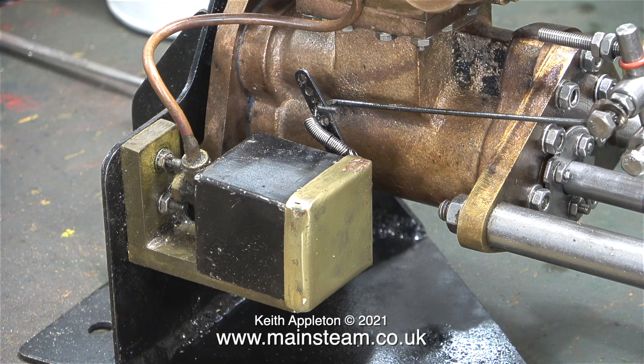By using a flapper wheel in the bench-mounted Proxxon motor tool I can clean it up easily. Once I've cleaned up the lid I've fitted it onto the lubricator. I haven't gone overboard with the polishing — I need the lubricator lid to match what is already there and not be too shiny.